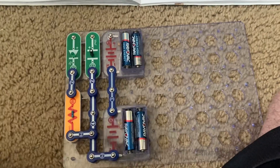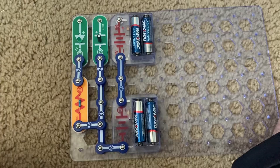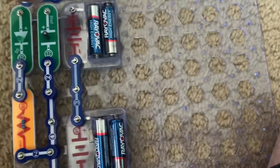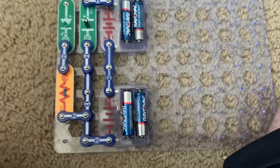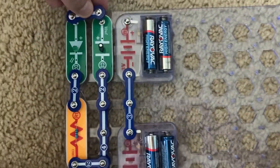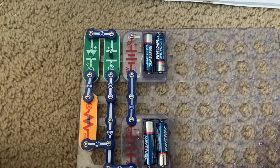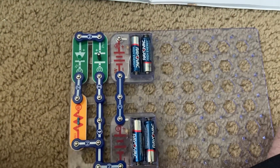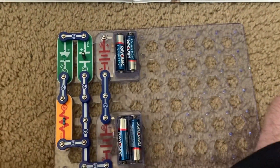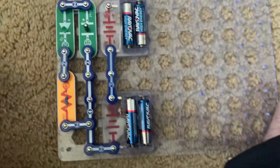For Project 205, Make Your Own Battery 3, I kept the C3 capacitor from the previous project but replaced the R2 resistor with the R1 resistor. Repeating the same procedure as in the previous two versions, but this time the LED blinks for an even shorter time. That's because the R1 resistor provides less resistance, and therefore the current stored in the C3 capacitor dissipates much faster.